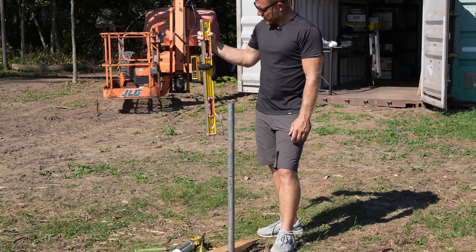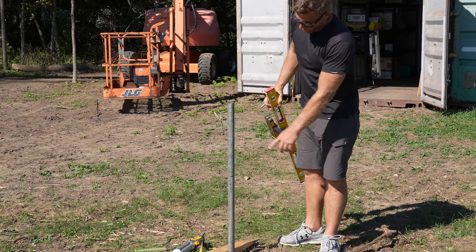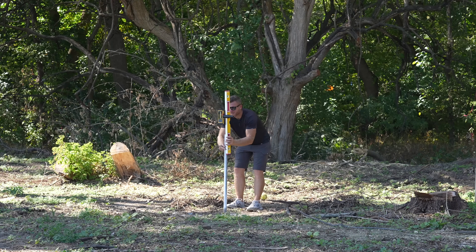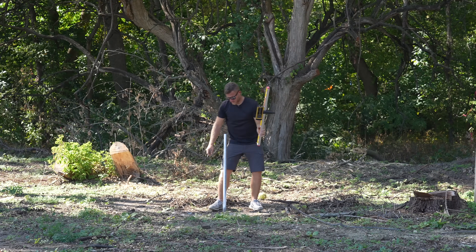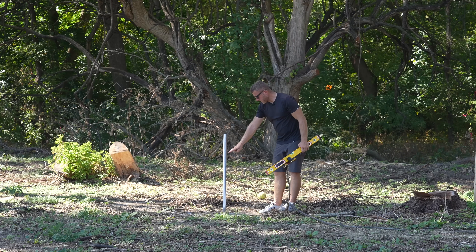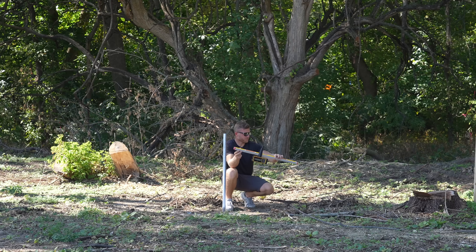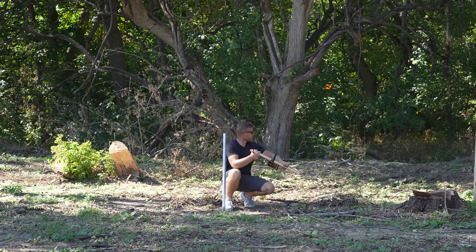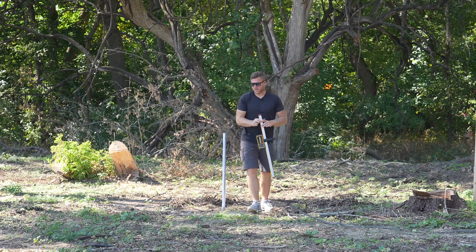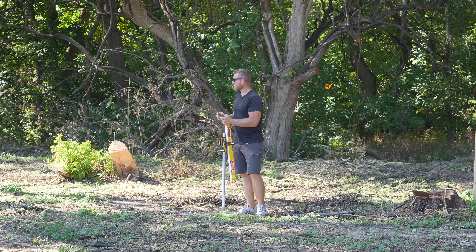I just want to see how far out of the ground it is on that back corner, but this I won't move — this will stay here. Right about there — so that's top of wall. That's really not too bad to be honest. By the time I do backfill, that'll slope real nice and gentle. I like that. I like being up out of the ground — that is way better than being in the ground where water is going to collect.